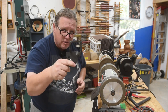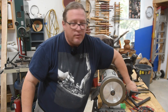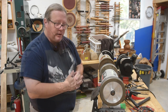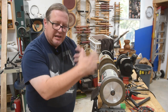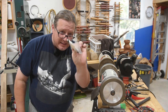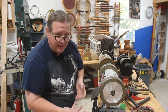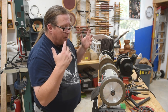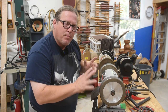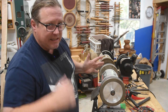You can make little homemade jigs to compensate for the extras if you don't want to spend the extra $60 — there's lots of information online on how to build that stuff. Upgrading to diamond wheels means less abrasive in the air when you're grinding, it's a lot cleaner, especially if you put a magnet inside a little baggie under your platform to collect all the metal shavings. Plus there's less chance of them exploding, which is why you need guards on friable wheels. But that's something you can purchase way down the road after you've sold enough bowls to justify it. But that's enough about equipment — now let's get to sharpening.